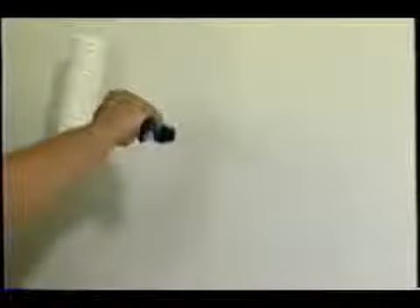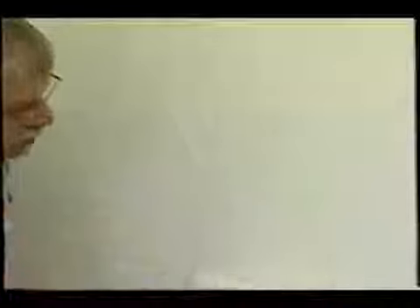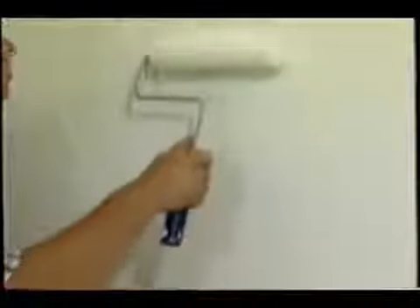The way to do it is to actually start sideways — put your paint on the wall sideways — and your finish strokes need to be vertical. You just go over the wall this way, holding the roller evenly with nice smooth strokes, and when you finish rolling, lift the roller off the wall gently.